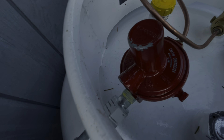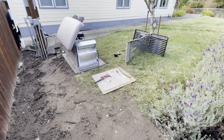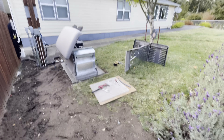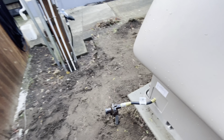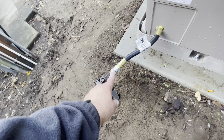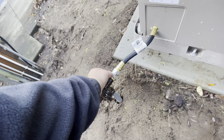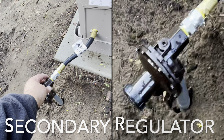It's a 10 PSI regulator. There's a little swivel here — you have to make sure that you don't put too much Teflon tape on, or else you can't tighten it up tight enough and it'll leak around the middle. So don't overdo the Teflon tape.